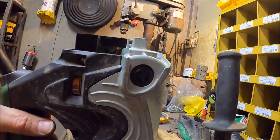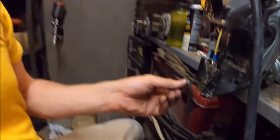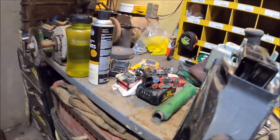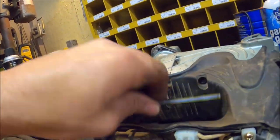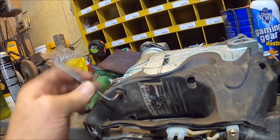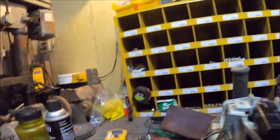See if we can get it to do it again. Nope, she's gone — dead in the water. I'll pull it back apart and see what damage there is. There must be something still shorted out, despite what everybody says. That armature was hot — I honestly think there is something wrong with the windings in that armature, which makes sense because it didn't really pass the growler test. The growler test showed a possibility that something in that armature was grounded out, even though it doesn't read on an ohms test. He said he's cleaned those out and ran them fine even though the growler test showed otherwise, so we gave it a shot.